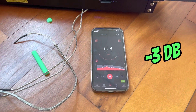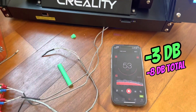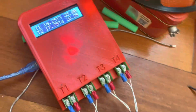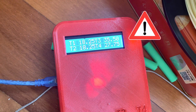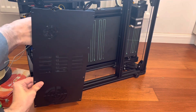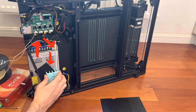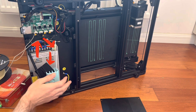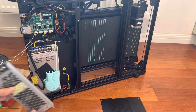For the sound testing we're reading as low as 52 decibels, though the stepper motors are still pushing up to 56 decibels at times. But looking at the temperature, things got pretty bad — the internal air temperature is now reaching 35 degrees. I think this is due to a couple of reasons: one, the cover is slowing down the airflow, and two, the air is now circulating inside the box rather than ventilating out. I think I've got a better solution up my sleeve.